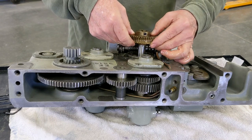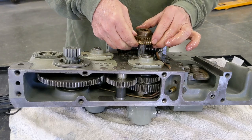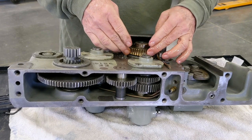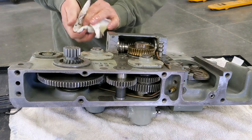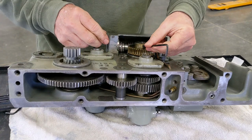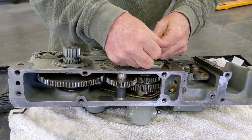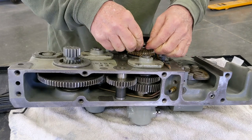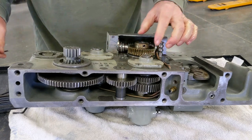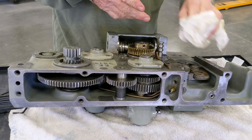Let's get this key lined up. There's a grub screw right here. You can see there's a woodruff key in that shaft. I might have to go get a soft blow mallet to tap that thing down. I'm happy with where that is, so we'll get that gear out of the way and tighten up the grub screw. There was a small depression in the shaft that positions this gear front to back. I don't think there's any need to put excessive torque on that. So now we'll go round up the half nut parts.